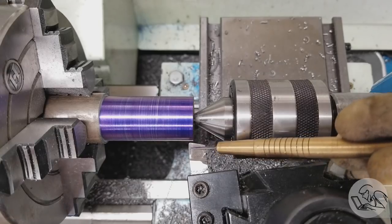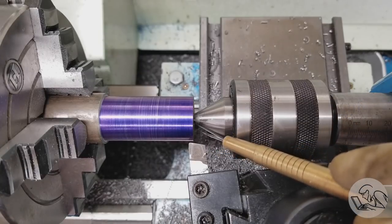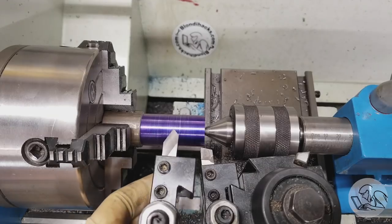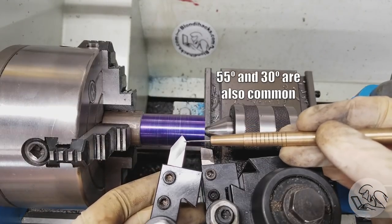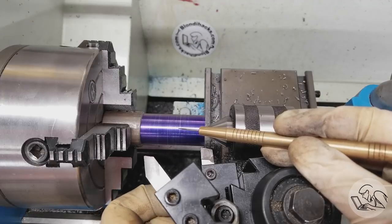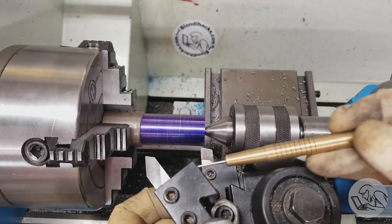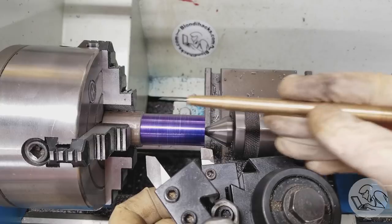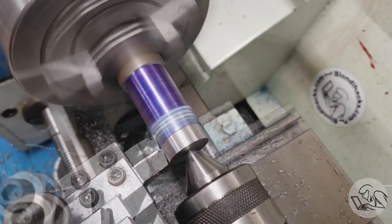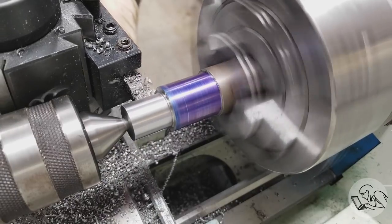Here's a classic problem when turning small diameters. This tool has an 85-degree angle on it, which is pretty standard for a turning tool. But this little space in here is only 60 degrees because of the angle of the live center. And we can't get very close to the work because of the mass of the live center hitting the tool post. One alternative is to use a 58-degree ground tool, which would allow me to get into that little space. But the problem is that in order to get a nice clean shoulder, I'd have to run it at an angle, and then to keep clearance around the live center, I'd have to push this tool way out in order to reach the stock — and then I've lost all my rigidity. So I'm going to show you a couple of ways around that. There are also special tools you can grind or buy as inserts designed for this type of situation, because it is pretty common.